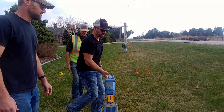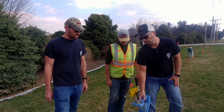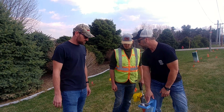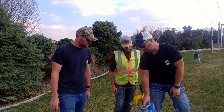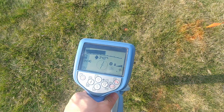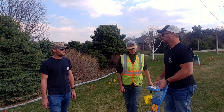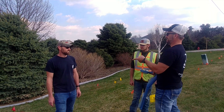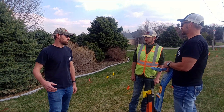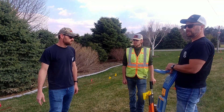We got anything else in this corridor? There's a stronger signal here. Yeah, looks like you're picking up cable. Cable. Look at the depth there — 1'5". I hope the gas is a little deeper than that. And he only got a 0.3132 milliamp reading, and I got nothing. I think this wire's got to be cut, or there are just no anodes. Older line. No continuity. There's no continuity back to ground.